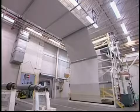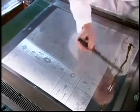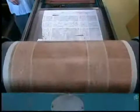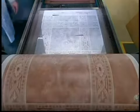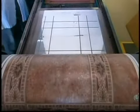The floor's design will be printed directly on this foam surface. A graphic designer creates the artwork by computer, then with a colorist, experiments with dozens of color combinations before deciding on which ones to use. The computer breaks down the final design by color in order to produce an engraved plate for each one. Then they test out the design on a piece of foam, printing one color after another until the design is